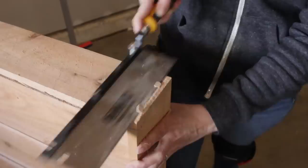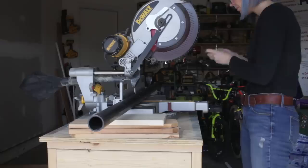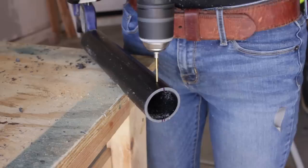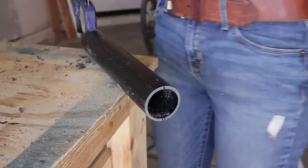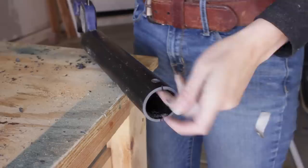Next, I began working on the leg assemblies. I told you I was going to use PVC, and for my first couple of experiments I did, but then I decided ABS is lighter and stronger and would work better for this application — although I did use PVC pipe on a different part of the build, which I'll show you later. I used my miter saw to cut the black ABS pipe into my leg lengths as well as stretcher pieces. I then found the center of the pipes and began drilling three-eighths inch holes all the way through perpendicular to the edge.